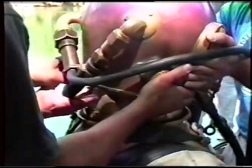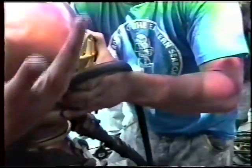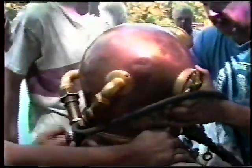And see this right here? Get this out of here. That's the way you're supposed to go. Coming down, that's going down. Well, that's coming over the diver. What you do is lower down the ring, get your hands out of there. You're guiding it down to him. Now you put it a quarter turn and go right there. Now back tender, you hold on to the goosenecks. Right there. Back right tender holds the collar. The front tender swings it. Hold the breastplate down and simply twist it around until it locks.